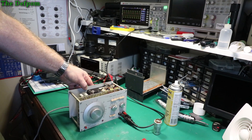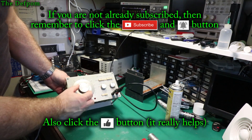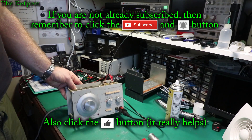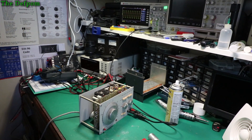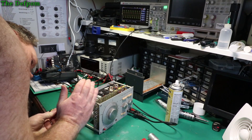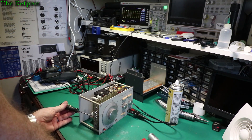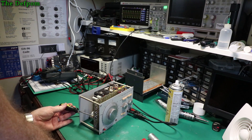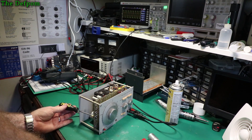So what I've got to do now is actually calibrate the frequencies. I'm in range 3, which is one of the 10kHz ranges. I've got 10kHz set on the dial. I should have that basically set exactly on 10. I need to calibrate for the voltage and the levels. I've got to do RV1 and RV6 for 10kHz and 2.5V RMS. RV1 and RV6 — I'm not sure which one's which as far as what they do, so we'll find out. So that is adjusting frequency, I think.